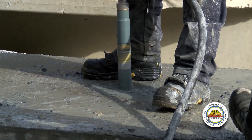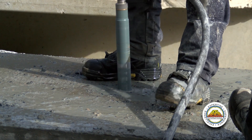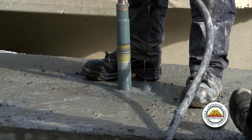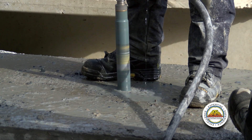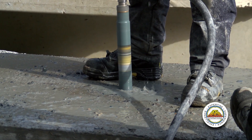When you see an edge of concrete, it's real easy to tell how thick it is. But I might be on the top of a pile somewhere, and that edge may be way far away or buried under debris. I may have no idea how thick the concrete is that I'm going through, and by coring I'm going to learn that.